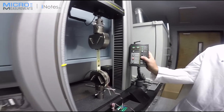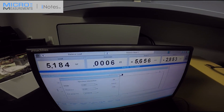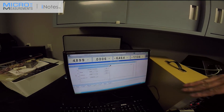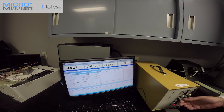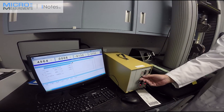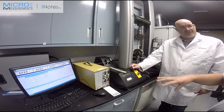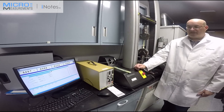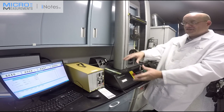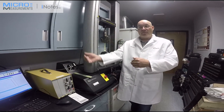The first thing you want to do is zero out the load. I had pre-zeroed the value and see a compressive load of seven pounds. I want to take as much of that out as possible — now I've basically zeroed out the load on the coupon. The wires run into these 2310A signal conditioning amplifiers, which take the signal from the strain gauge, condition it, and provide a higher-level 0–10V output. That signal goes to the Instron's conditioner input and is converted to strain.